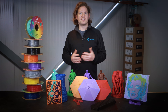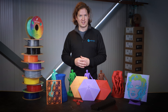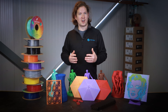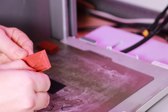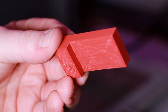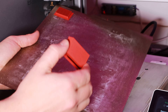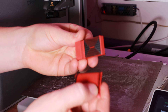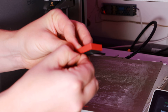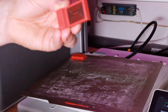To do a quick test, I printed a simple support test without making any changes to the standard support settings. The PLA warped away from the far end but showed promising adhesion signs near the corner. I ran the test again but changed the Z-distance gap to zero, so the Co-PE would be printing directly onto the PLA with no air gap, and used Co-PE as the interface layer to speed things up. This time the results were much better, and I got a good idea of the feasibility.